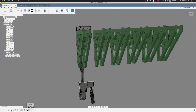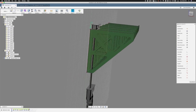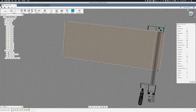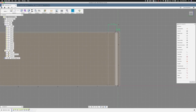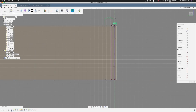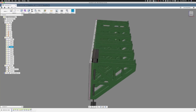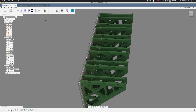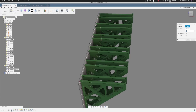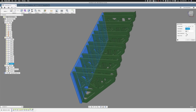Here we're going to draw a sketch, which is pretty much just the backing of the piece. Turn off all these bodies so you can see the clamp a little better. We also draw in our dado to extrude and cut out that body in the back. Then all we have to do from here is Combine — we're doing a boolean essentially — with Modify, Combine. You select your target body, which is the thing to modify, and then the tool bodies, which are all of our different arms. We want it to Cut, and this is what we result in.